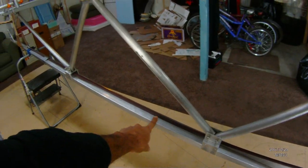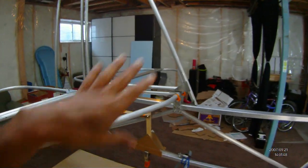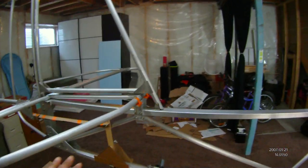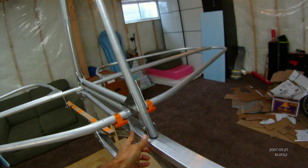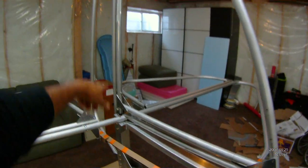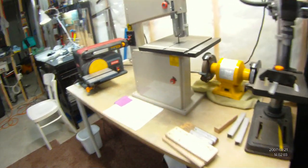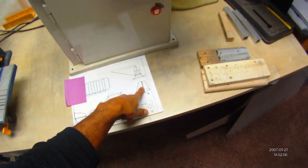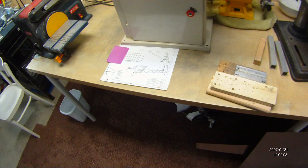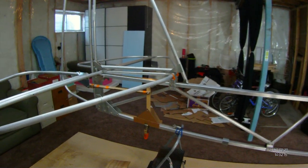This is the elevator pushrod here, and in the last video — video number eight — I focused more on my changes back here. This is how I mounted the horizontal, and I put a bracket back here versus just a bolt through. I also made this vertical stabilizer a bit bigger than the plans — changed it from more of an RV6 look to an RV7 sort of look — a little bit bigger, and my whole purpose was to decrease the adverse yaw this thing is going to have.